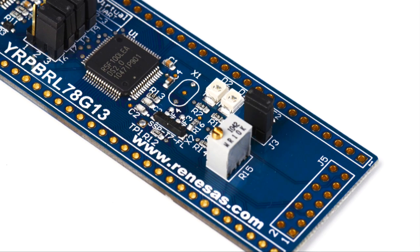First, true low power. RL78 offers very low power operation with 140 microamps per megahertz power consumption at 32 megahertz and 66 microamps in no-op, putting RL78 into the best-in-class category for the 16-bit MCU world. Low power consumption is exhibited in two significant ways: one, power consumption of the MCU itself, and two, efficient energy implementation of the end product the MCU is controlling.